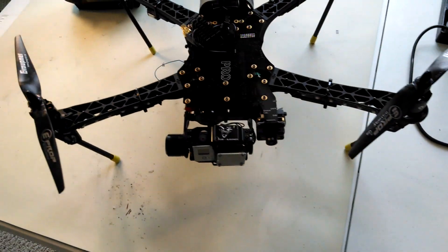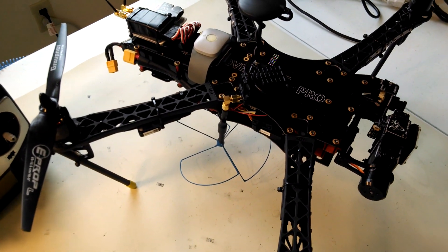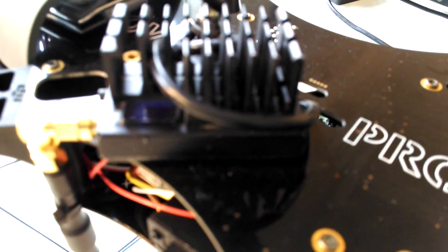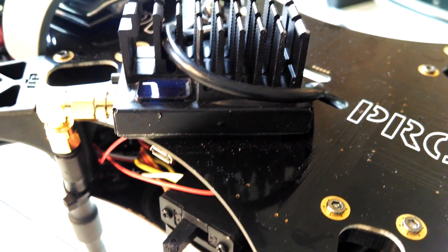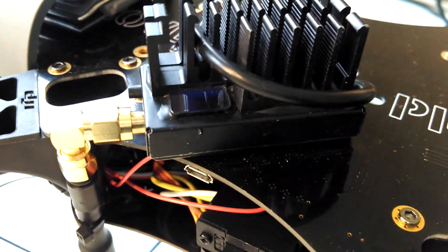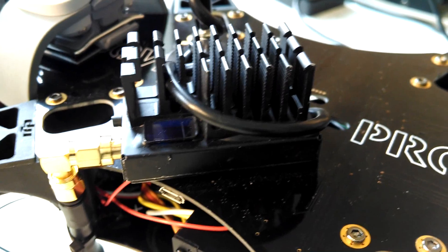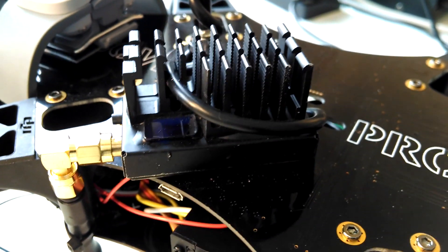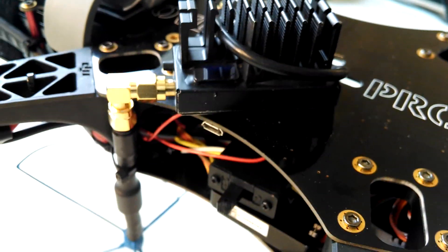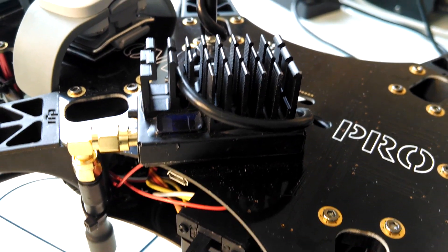In exchange, I went with the ready-made RC 1.3 GHz system, which I've modified fairly extensively from the case it came in. It came in a big aluminum case — I stripped it right down to the transmitter module, cut the top out of it, installed an aluminum slug along with a heat sink, and using thermally conducted epoxy put the thing back together. This transmitter works really nicely — I've had it out over two miles and get crystal clear video back on it.